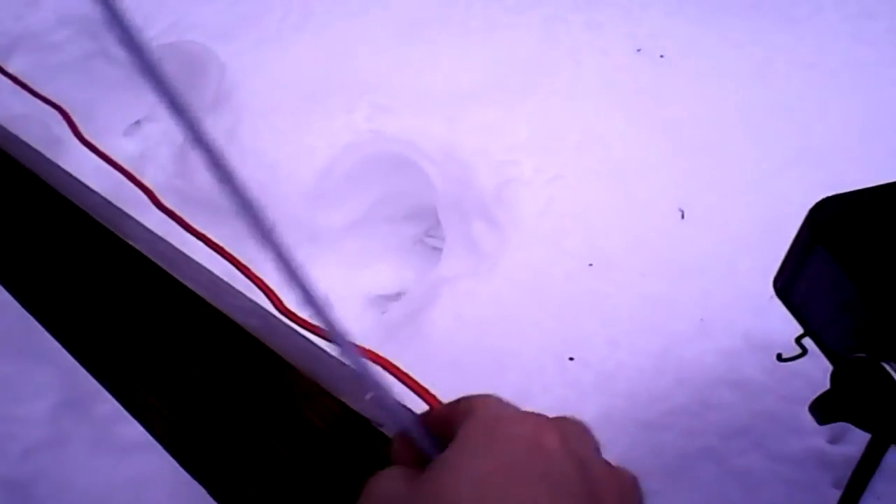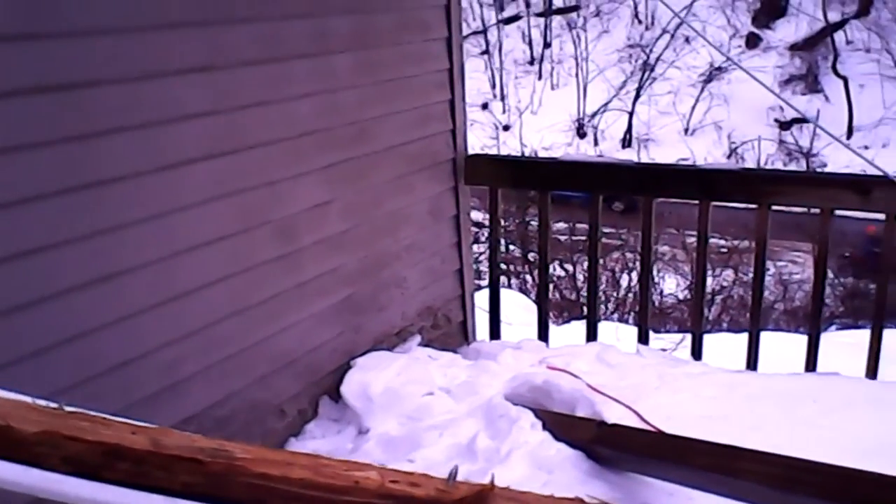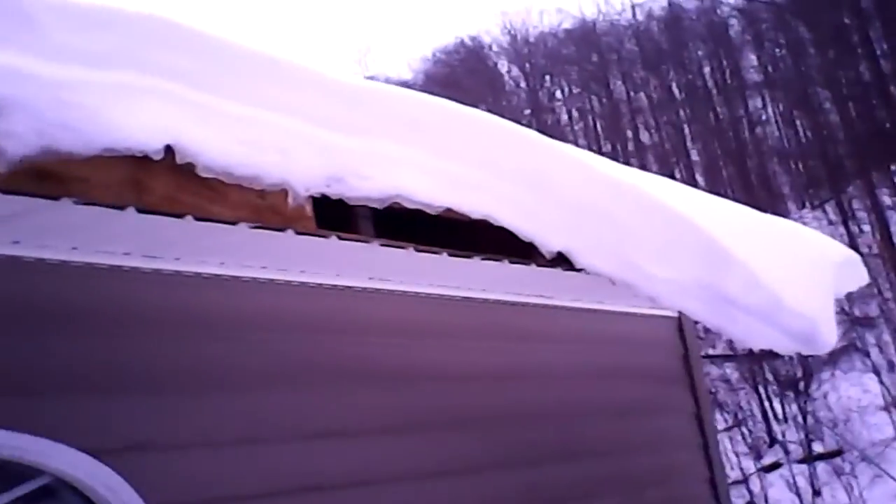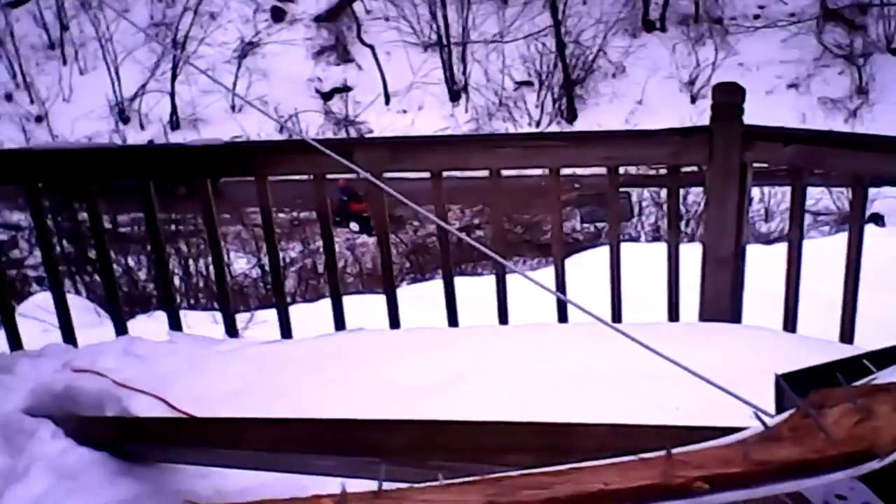Your coax here is not too tight — it's got some slack there. So what I'll do, if I can, I'll see if I can disconnect the coax. I don't think the pole is going anywhere, but I'll disconnect your coax and pull it back and lay it over in a corner, maybe wrap it in something or put it in a can to keep water off of it, so that when this ice comes off, it doesn't cut or damage your coax.